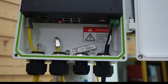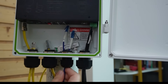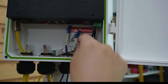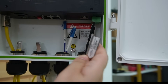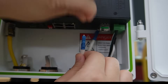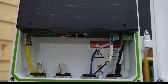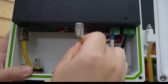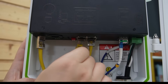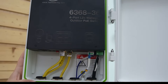Now I'm going to put my fiber optic cable through here. Since we have two strings, make sure you know which string you're using — let's use string C. I'll slide in my SFP transceiver into the SFP slot. Now this is string C, let's connect it. So now we are getting the data. We have two cameras and one access point, so I'm going to connect three ethernet cables — one for the access point and two for the cameras. Now it is all set.